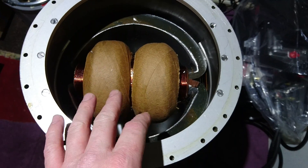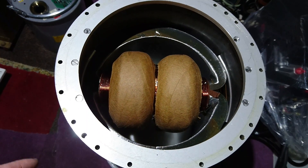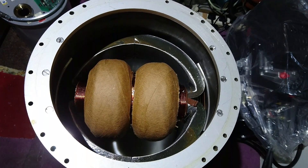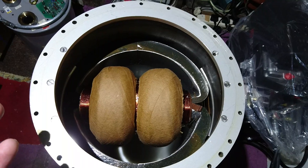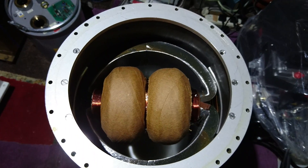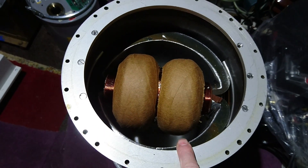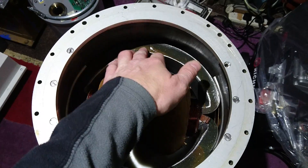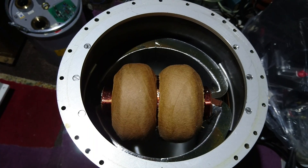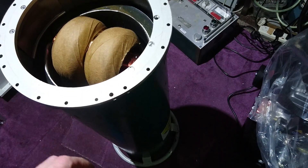120kV — this has an inert gas inside, a fluorine-based gas — I can't think of what it's called right now. It's safe to breathe, well, not too much I'd presume. That sort of gas would make your voice go very, very low, so you'd be talking like this. The gas is quite safe, but you wouldn't want to get an arc into the gas as it would make it very toxic and would probably eat your flesh away, as I was told by a good friend of mine.